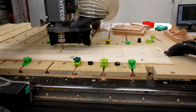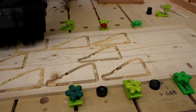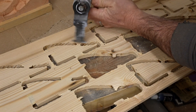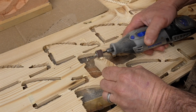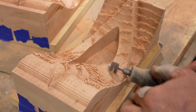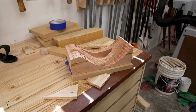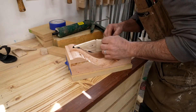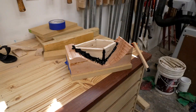My idea was to fill this middle area with epoxy, but it would just flow out the edges and I needed some way to contain it. So I designed a basic 2D wall shape that could easily machine out on the CNC out of some scrap pine I had laying around. These pieces needed a little cleanup with a sanding drum on the Dremel. I also decided to remove some of the fuzzy bits left on my workpiece caused by the upcut bit. My idea was to use some silicone sealant to glue these side pieces onto my workpiece and create a little pool area that could fill up with epoxy.